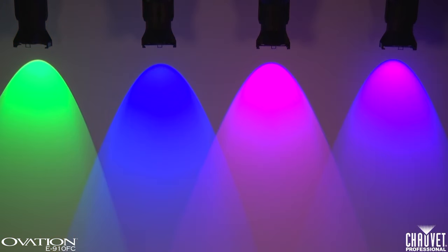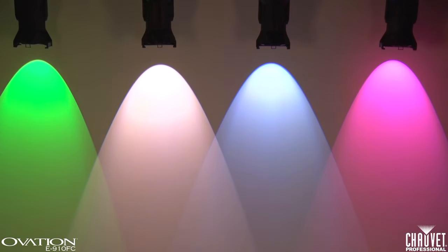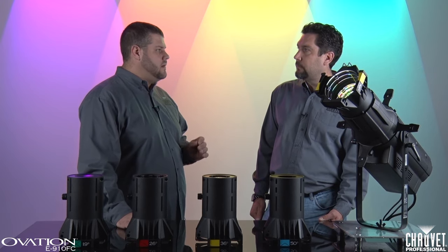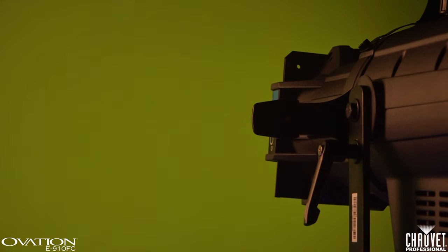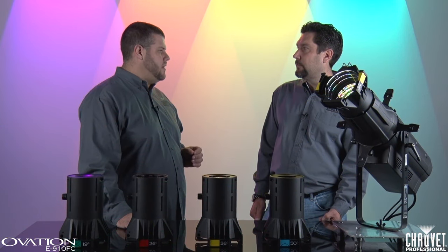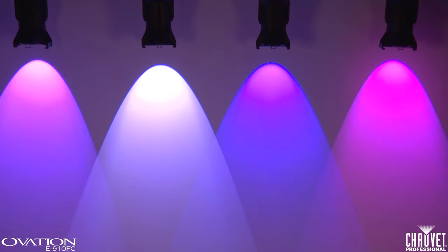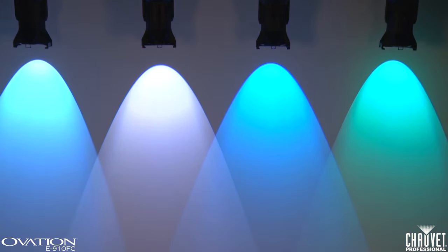So what's the great advantage of using lime LEDs? Lime LEDs are really unique. They fit perfectly into that wavelength that the human eye sees the best. So what this does is it actually allows the fixture to appear brighter to the viewer, and it also falls into a sweet spot for color mixing, so it's a lot easier to mix subtle hues. And it actually helps the CRI quite a bit — we're up over 90 in most colors.